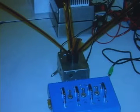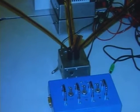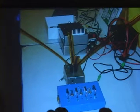Here you can see the antenna a little bit better. Notice there's this Delrin cup that's been milled out to allow the antennas to flare out. And again, it's made out of the same material that a metal tape rule is made. And I'm going to show you a picture later on. The idea is that they can be folded and then put a piece of Velcro around it to bundle it up so that they can get SuitSat through the airlock and then let go of it and it'll deploy itself.